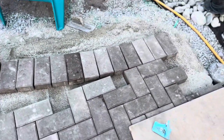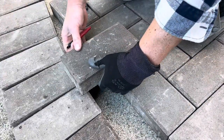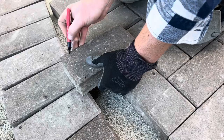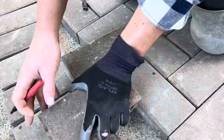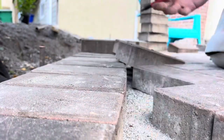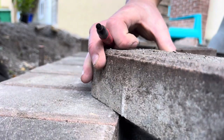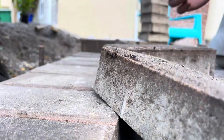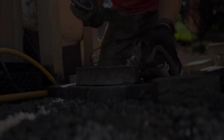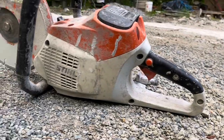So inside, outside, then the tight radius, then it flows back into that point in the corner. Let's look at some actual marking and cutting. Each company is going to do this a little bit different. I find it nice to use either a marker or a pen — something that's not going to wash off or get blown off when we're cutting. Just set the pavers up in with our pattern on the soldier's course. I'm looking directly down and just making a couple of points on each end. Then I can line those points up when I'm cutting, either using a small grinder set up for wet cutting — definitely don't use just a regular grinder — or a small cutoff saw.